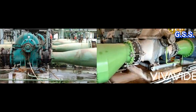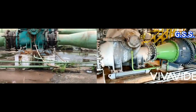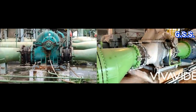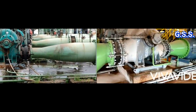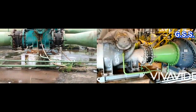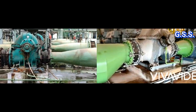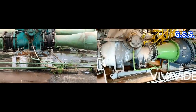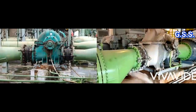Number five: water leakage through pump gland. In both installations, a drain line has been provided from pump gland. But still, a lot of water is coming out from pump gland. The surrounding area is becoming wet and slippery, and water is falling on the pump motor base frame continuously. We cannot prevent this water leakage from pump gland, but we can provide one small drain by the pump, and we should provide grouting up to base frame top so that the base frame will not be corroded.